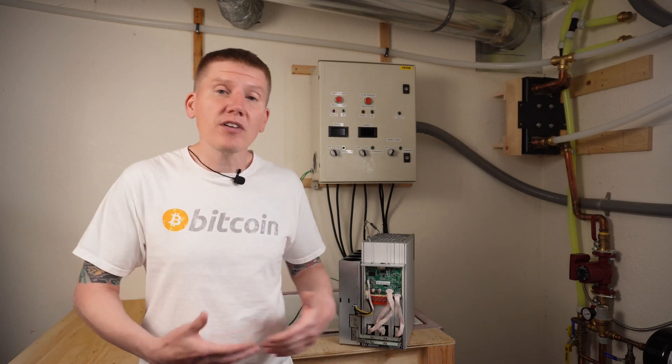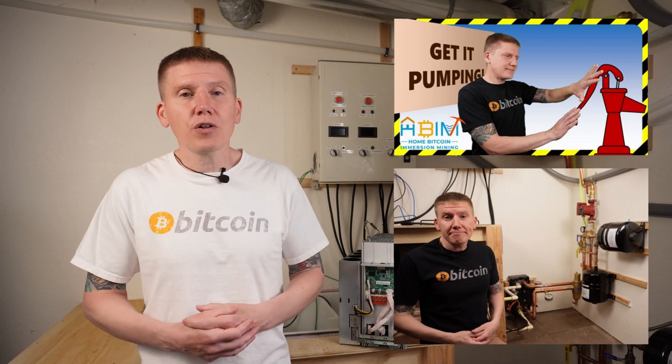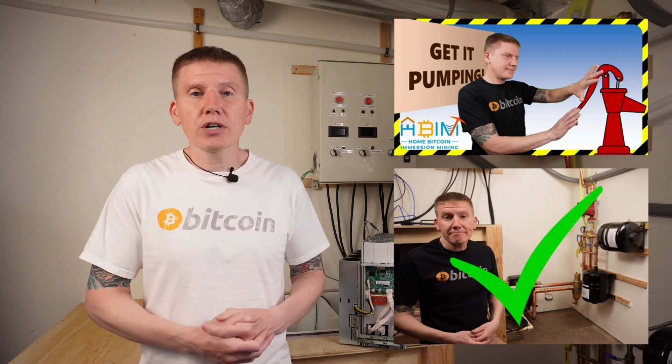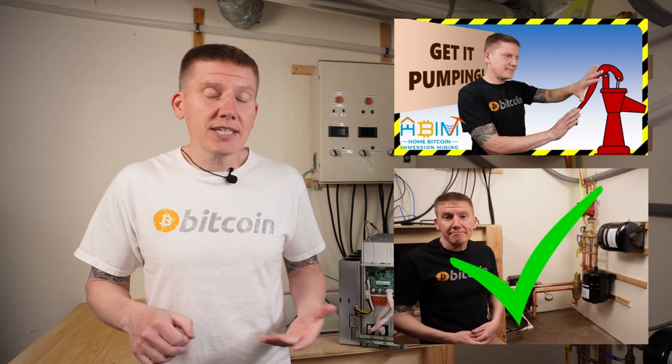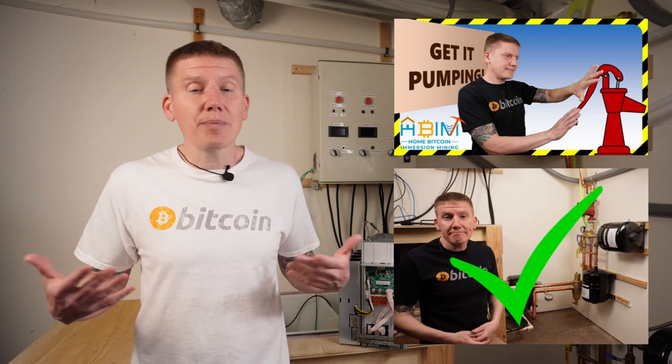That brings me to the next part of my dual loop system, which is my hydronic system. I was pretty confident with that design — there are lots of design tools out there for hydronic systems, it's a well-known technology, and if you just do the math you can make sure your system is going to work. And the system worked fantastic. My makeup system did a great job keeping my system under pressure. My expansion tank was sized correctly, my pump was sized correctly. I stayed on the lowest setting, so I've got another two speeds with my pump — when I want to overclock, I've got plenty of capacity there. All in all, that entire half of my system was designed and worked well.